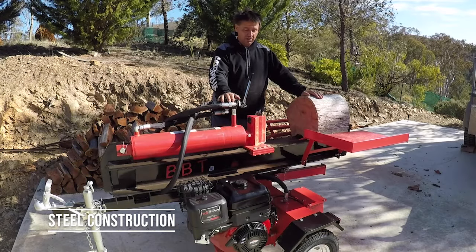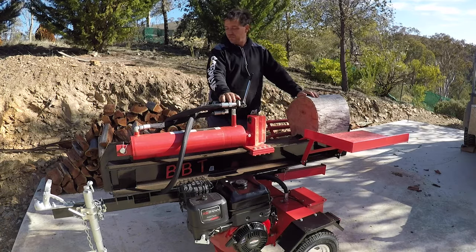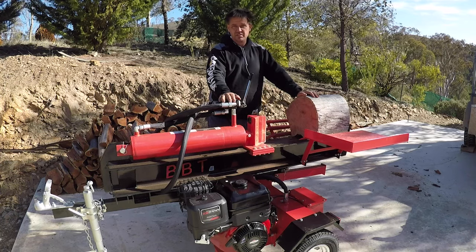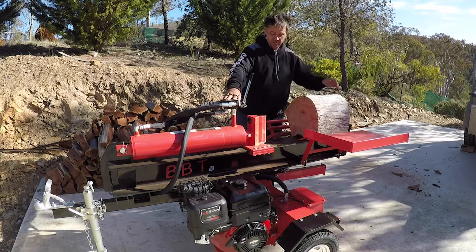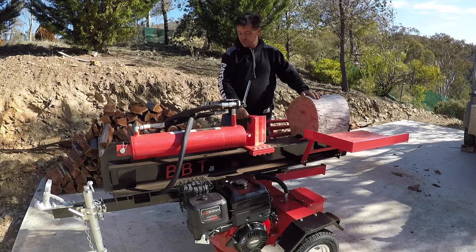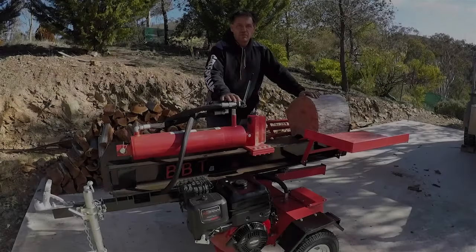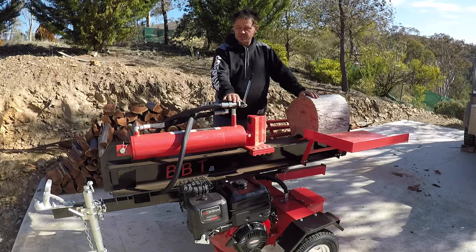It's very important — everything on here is steel, there's no plastic. You've got your I-beam construction, which is very important and very strong. It comes out of the mill as an I-beam; it's not welded, so it's effectively forged in. You'll notice a 50mm solid base, a solid wedge, all steel side tables, and the steel tank that holds the wheels — the hydraulic — it's all steel. We reinforce it all at the back here as well. So without wasting any more time, let's see how this baby goes!